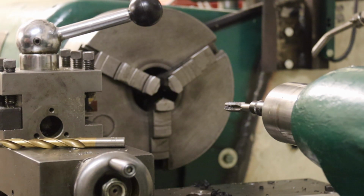So I'll do the other two. There's no point videoing doing two more of exactly the same as I've just done. But there you go. Gone from half inch UNC to half inch UNF by just welding the hole up in the middle. You know, it gets you out of a fix sometimes. So that's just a quick video. We'll call that it for now and see you in the next one.